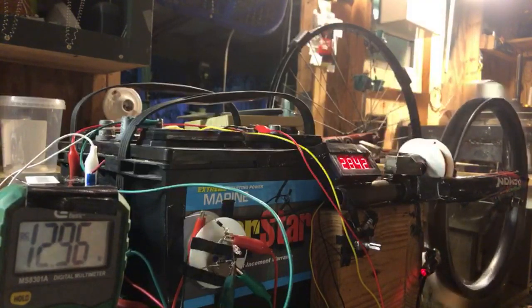That's why I think the whole key here is digging deeper into the wave profile of the Schumann resonance. Like actually hooking up, put an antenna up, put a grounding rod down, put a variable capacitor in there, and also put a regular capacitor in there, so you have a plate of the ground and plate of the air, and then a variable coming off of that so you can dial it in, and then an oscilloscope so we can see the wave and see what we're getting. So I think that's what we need to do. I'm just talking this out with you guys right now as I'm thinking in my head, what do I need to do to pursue this a little further.